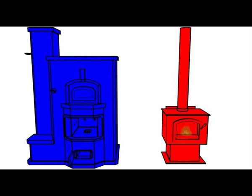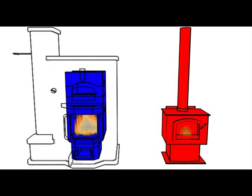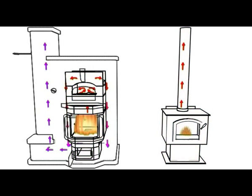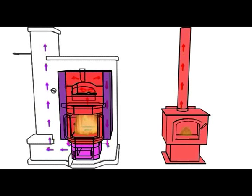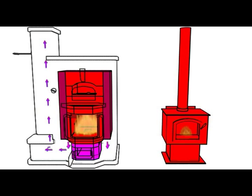The masonry heater differs as it is slow to heat up and puts out a very gentle radiant heat. Masonry heaters are lit in short bursts and burn at remarkably high temperatures, with a refractory inner core that promotes complete combustion. A masonry heater makes sure the full potential energy of wood is released. The hot exhaust gases of a masonry heater are redirected internally and heat is retained within the thermal mass of the bricks. A masonry heater extracts and stores as much heat as possible from a burn.